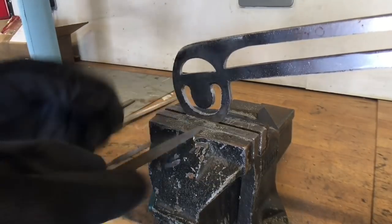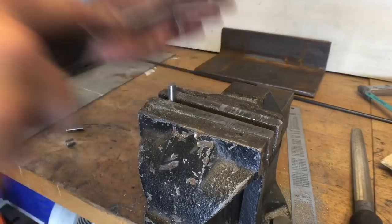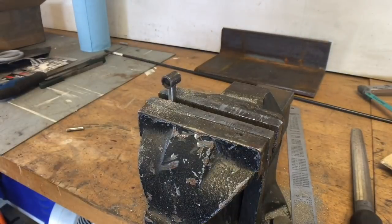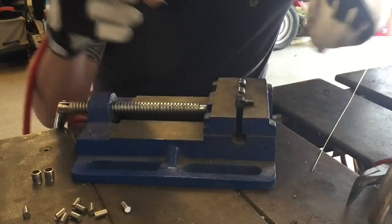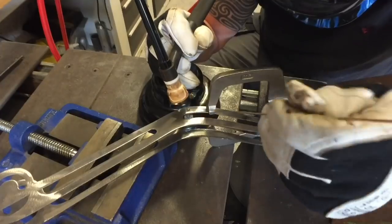When I thought about how to join the two pieces together whilst incorporating a cable hold, I came up with this idea of getting an 8mm rod with an 8mm tube, tack welding them together, and then just putting a plug weld through the two pieces to join them. There you've got that really nice incorporated cable way through the whole piece.